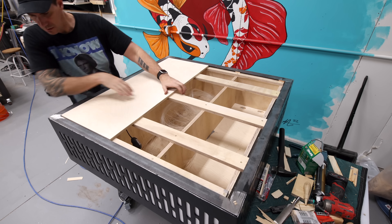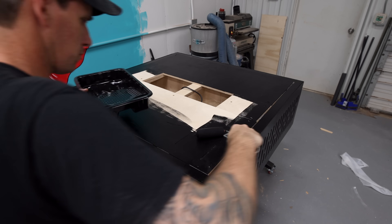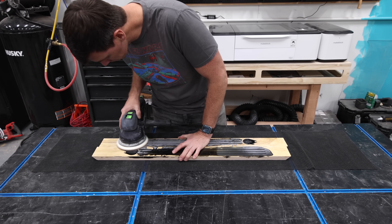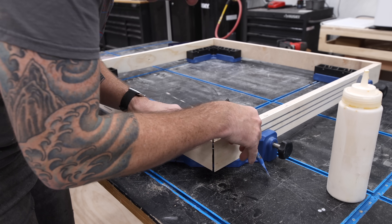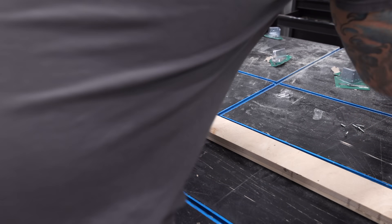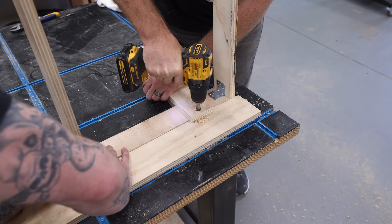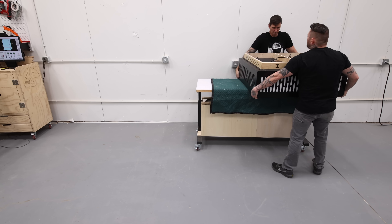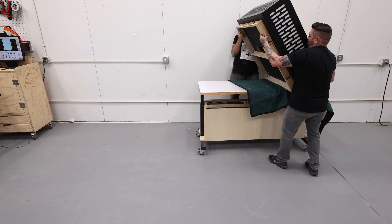I covered everything up with some half-inch plywood and left room for the plug to come through and access to the center if I ever need it later. Back to the base — the epoxy is cured and I can sand those down. I'm definitely not running this through the planer again. I glued and clamped the miter corners together, reinforced with corner brackets, and cut a spot in the base for the power cord to pass through. The base gets attached to the coffee table with figure eight fasteners, and Jeff helped me flip the whole thing over for the very first time. This thing is really heavy and solid.